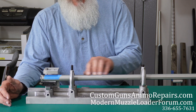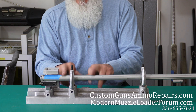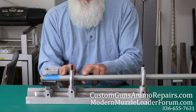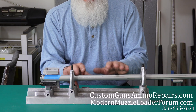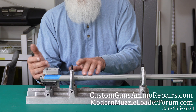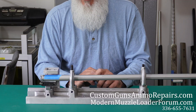That's really important. I get a lot of guns in where guys have had other gunsmiths drill and tap it and they can't sight their scopes — the scope runs out of adjustments because it's slightly off. Even though it's slight, it doesn't need to be much. When you're off only a 32nd of an inch at 100 yards, that translates into a lot of inches. Especially if the back holes are a 32nd or 64th off in one direction and the front holes are in the other, it's going to cant your scope base and make it very difficult to sight your gun in.